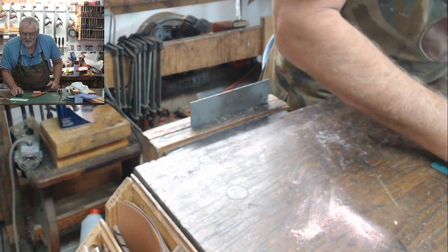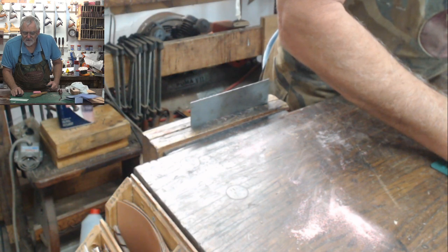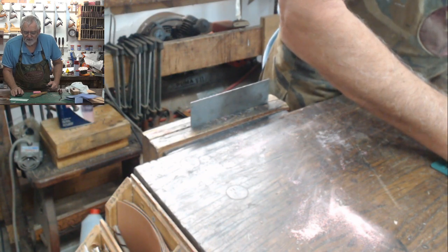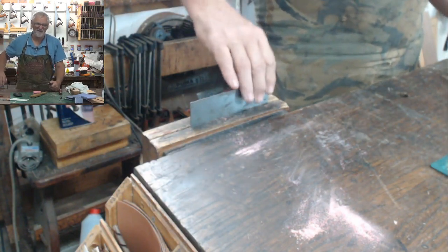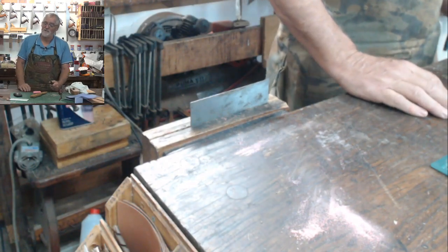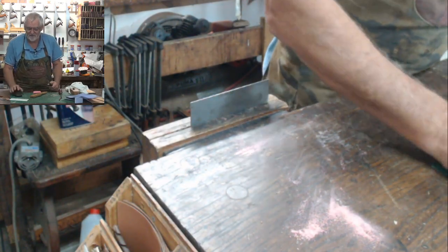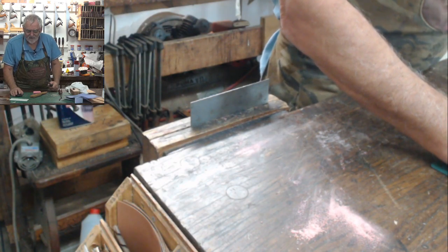Found the name I was looking for. It just takes time. There we go. And Steve is right, you have to work stainless quicker. I've tried to forge it in the forge. It is tough. It takes a long time to heat up, and it loses its heat really quickly as well. The company I was thinking about make good carving tools.